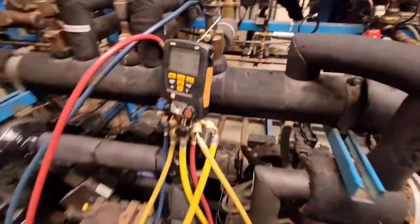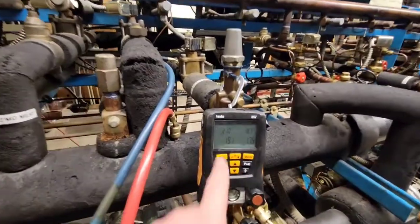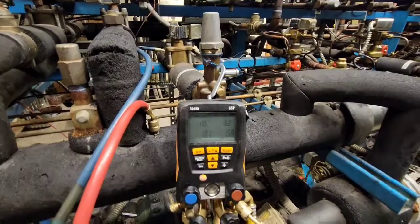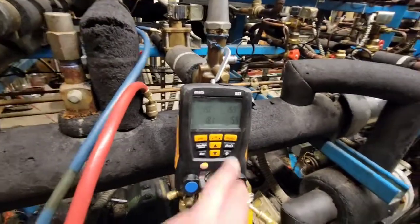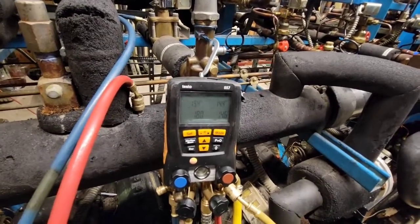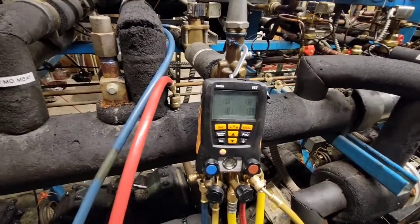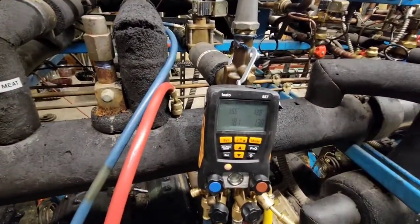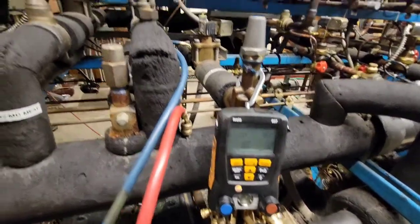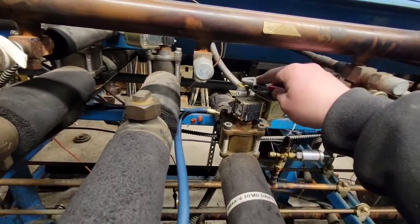So I'm going to look at it. You can see that it's bringing down the pressure on the case as well. Now as this goes down, we need at least 10 PSI — maybe 5 it could be. But we're going to keep going. It doesn't seem to be changing the EPR value, so I know that's more than likely what the value would set to. So I'm going to try and see if I can adjust it now — just do a little turn.